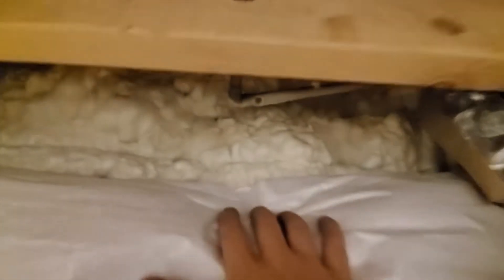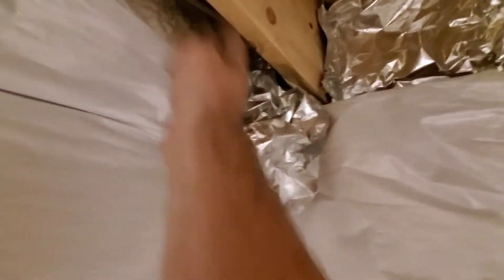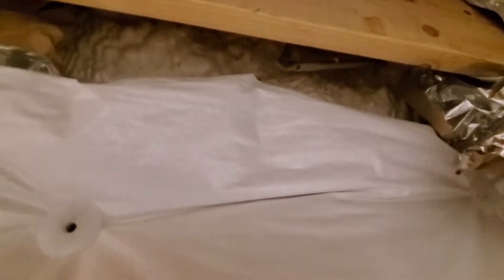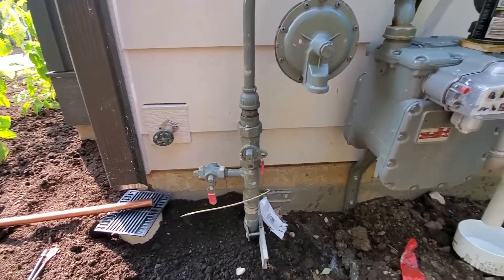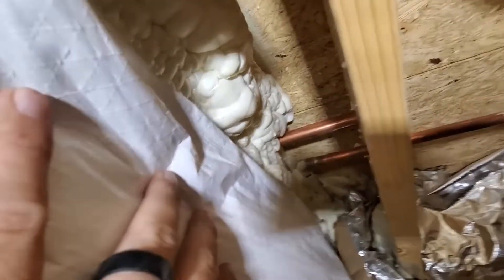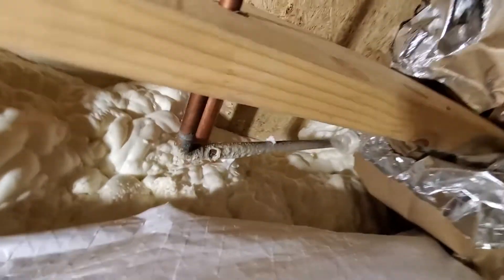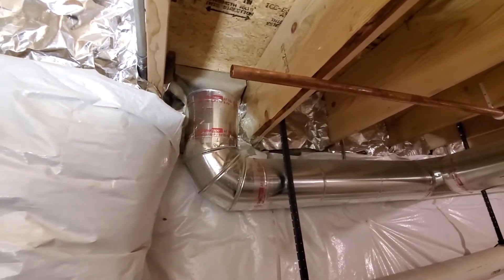Here I was looking in the joist space — there's a gas line and the spigot outside — to give me a measurement of where I can drill to get out. I'll go outside, take a look at what's there, and make a decision. We could always put it on an angle. So let's drill the hole. Outside you can see the gas pipe and the spigot — I'm going to come out right under there. You can see that's where we came through, put a 90, cleared the joist, and came down.